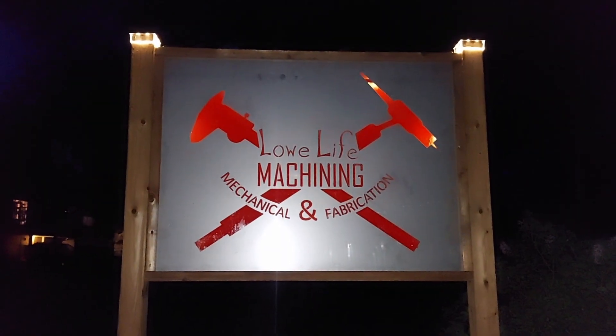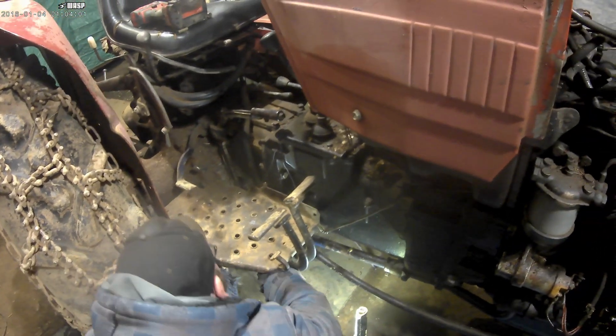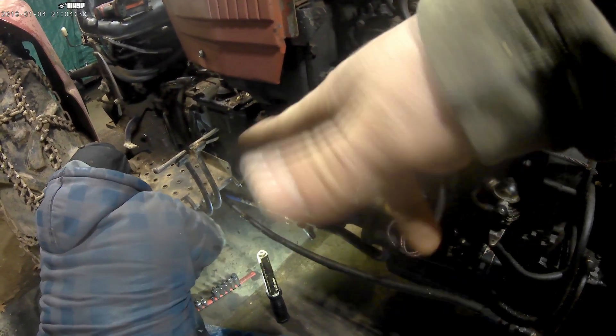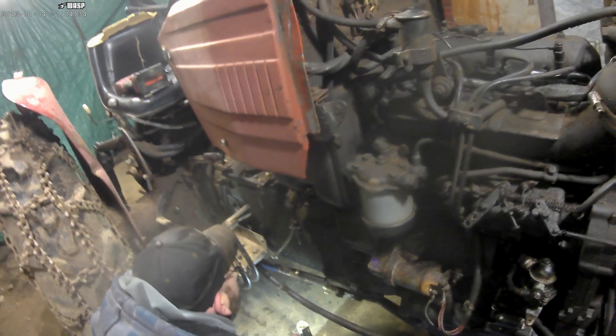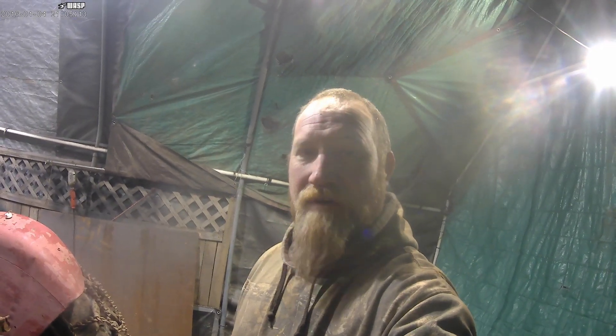Take a look and see what those seals are like. There are holes in the bottom of this and they have cotter pins sticking down through and they're kind of split — so as they hit tall grass, they spin and they keep the holes clean. Well, that's where we're getting quite significant leakage of fluid. That's just a spot from a relatively quick drive. We had brake cleaned it, wiped it all down, backed it in and out a couple times to see if we could get this to act up. But chances are there's probably no hydraulic oil in it — the owner said it'll just dump out as fast as you can basically put it in.